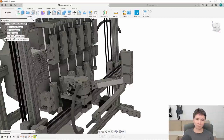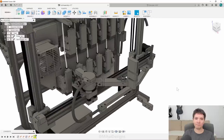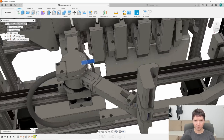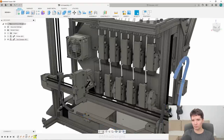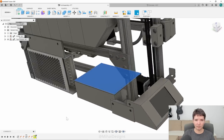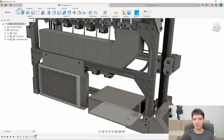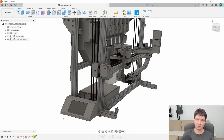For other kinds of crashes, there's going to be a magnet with a Hall sensor and a strain relief system, so whenever the arm pushes into something and starts bending, the Hall sensor will detect that and alert the system. These are basic safety features that I believe are very important, which is why I added them already from the first version. There are cables that go through here into this box where the electronics will be.